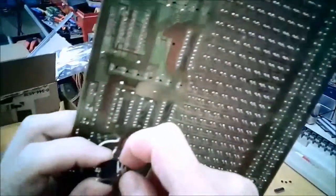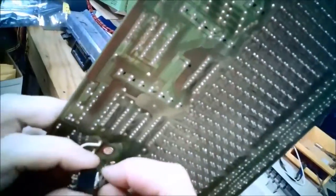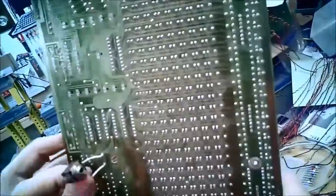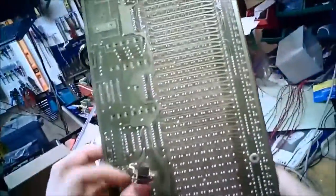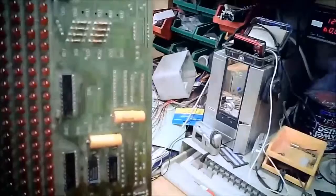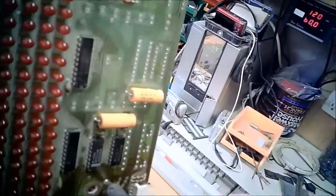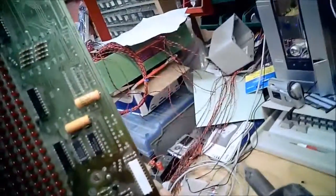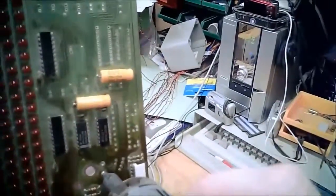So this is just a little sort of headphone type jack. Although it's kind of interesting that the knob is loose in it, just on 2 little wire stalks here. So this plane here, I'm willing to bet is either power or ground. Well, it's marked ground, so we'll go with ground. So I can just solder suck the ground out. Maybe. Again, there's a lot of copper and solder on that connection, so it's hard to take out.